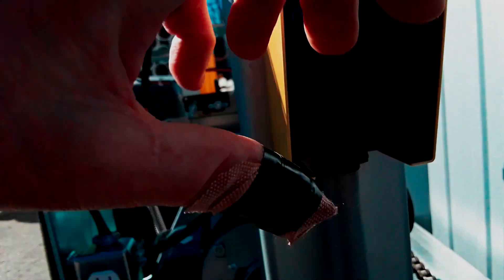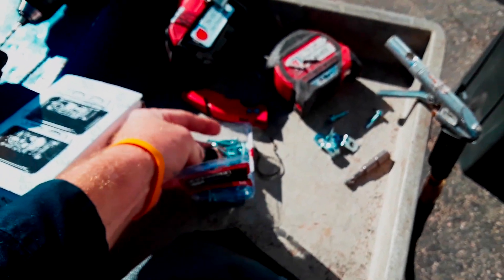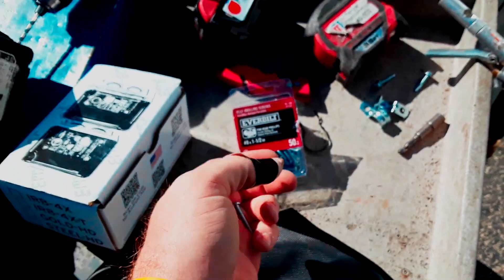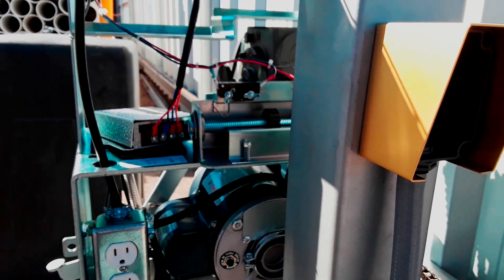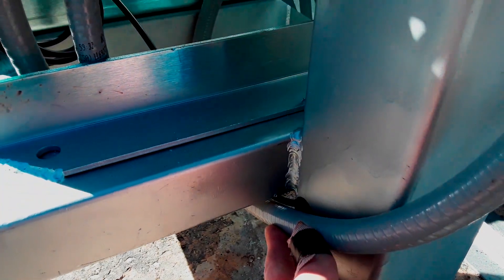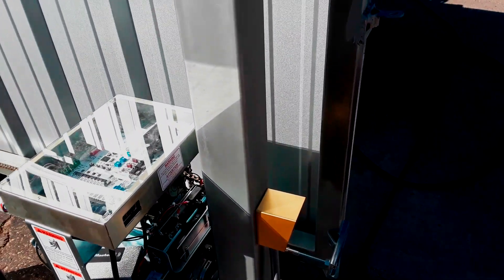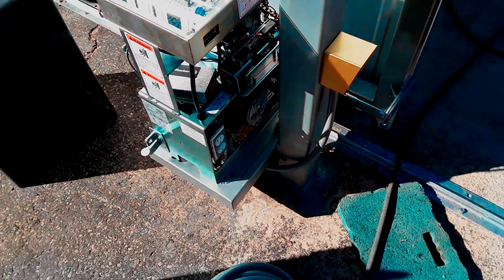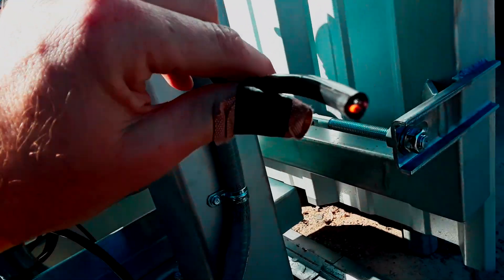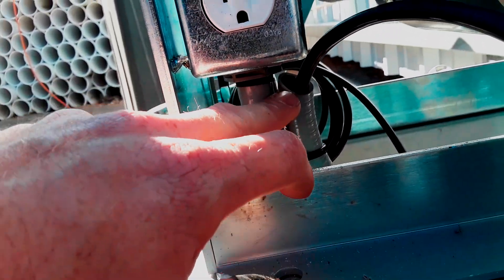The housing was pretty simple to mount — I just took a long skinny drill bit and marked it by squeezing the cordless drill gun a little bit here and here, got it catty-corner, and two screws are probably sufficient. I used number 8 self-tappers, Phillips head, inch-and-a-half long. We'll mount a strap here and another strap here to cover the coaxial cable for the long-range antenna kit — that'll be the transmitter side. Then we've just got a few more things: programming remotes and testing the gate operator.